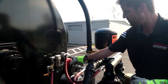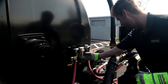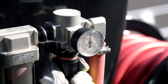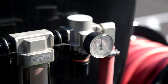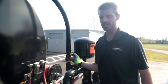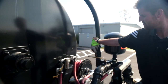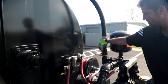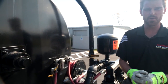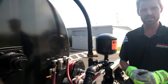With the gauge showing 85 psi and my pump in a neutral state, I'm going to dial this back to 80 psi. Now I've dialed my internal pump pressure back to 80 psi. I can go ahead and open my recirculation valve to recharge this system for a few cycles, then close my recirculation valve. My system's charged — I'm ready to spray material through my spray bar, drop material through my material drops, or use my spray wand.